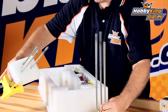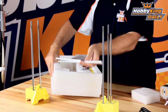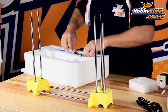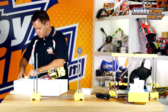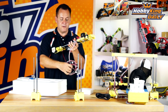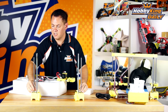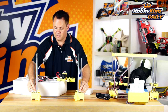Then we have our two cross rods right in here that go right across and plug in as the cross rods. Right here is our Z gantry, and it has our wiring harness on it. All you really have to do is slide these down, line up the bearings with the rods, slide it down until it contacts the two Z axis stepper motors, and start threading them down — it's threaded rod and it will drive that down.